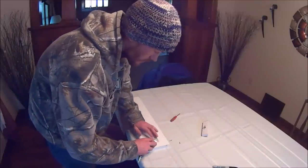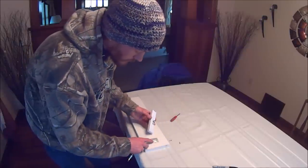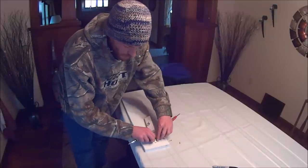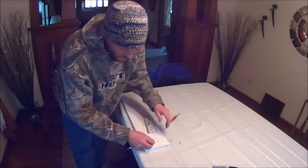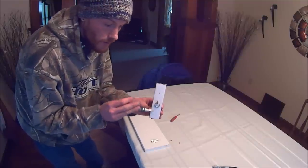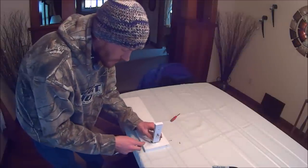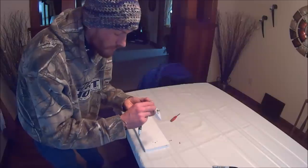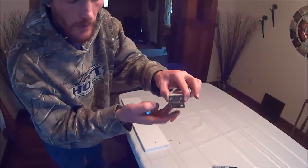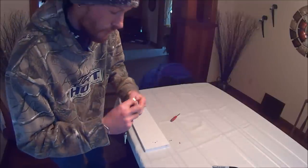Then take your hinge and your 1 by 1 and a half — these line up perfectly. Leaving your hinge resting on the board, close the hinge, then take your 1 by 1 and a half — with the front facing forward — set that on the hinge, open it up, and screw it right to the bottom of the 1 by 1 and a half. It should line up pretty evenly.